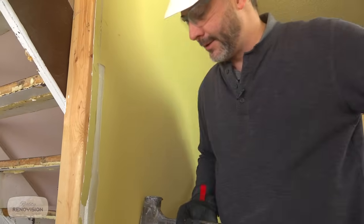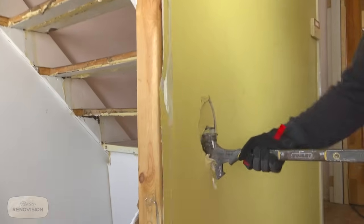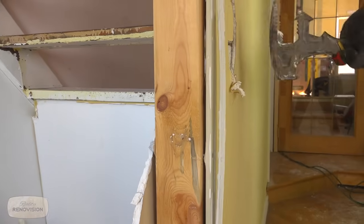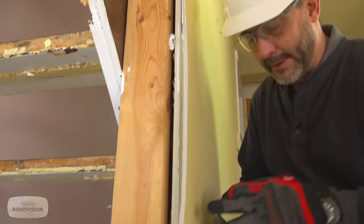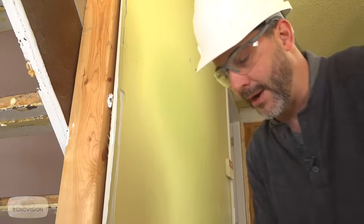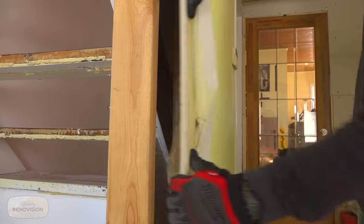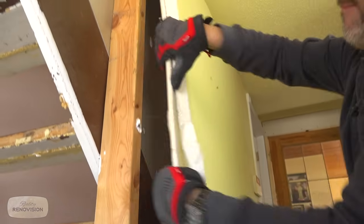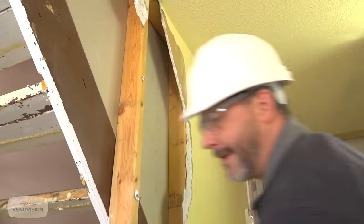I know there's no mechanical in here. And then, jiggle, all right? Here's the goal. If you jiggle the drywall, the screws that are in the surface, the head of the screw will pop through the paper and the drywall loses all of its strength. And then you can just grab it. Okay? And it usually comes off in pretty good pieces.